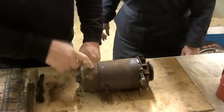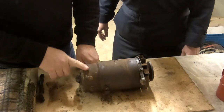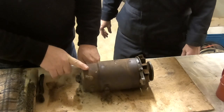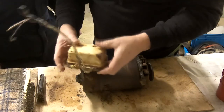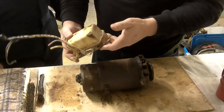This is an old backhoe — 1960s, early 60s technology — using a generator instead of an alternator. The generator provides a constant source of DC power, and because the engine and battery couldn't use all of it all the time, you had to have a voltage regulator to regulate that power coming in so it's properly distributed and used — otherwise you'd burn things up.